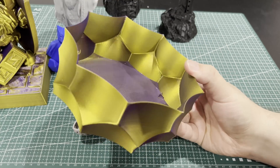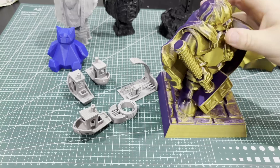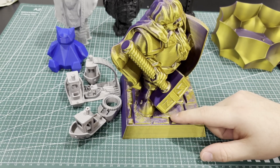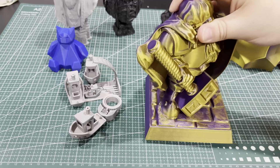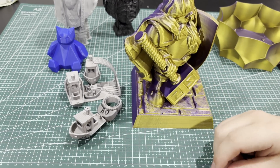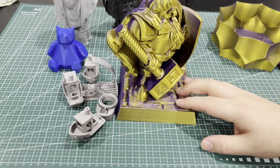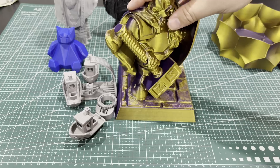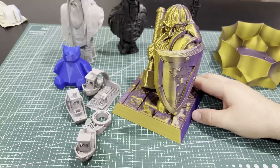I've been using it to toss little pieces of trash in, which is what you hear rattling around. On the subject of rattling — when it was doing the infill on the base at ridiculous speed, it did start to knock off little pieces of fill material. A couple small pieces broke off. You could dial the speed down five or ten percent and it would be fine. Some of my much more expensive printers do the exact same thing at much slower speeds.